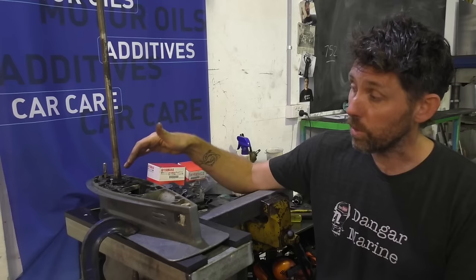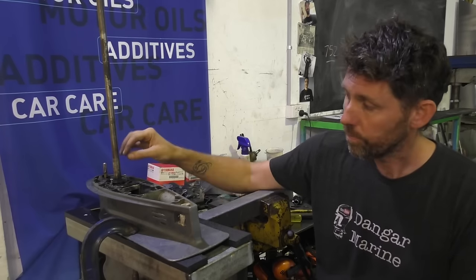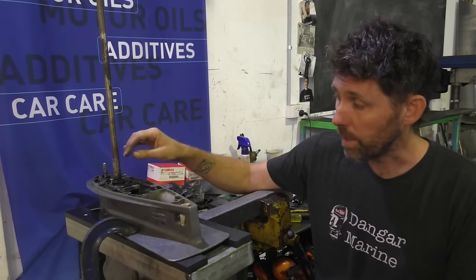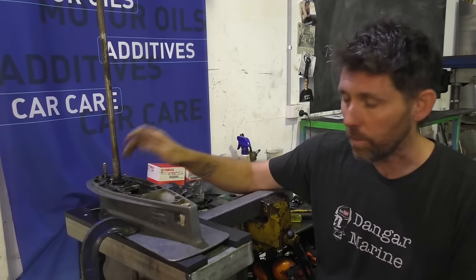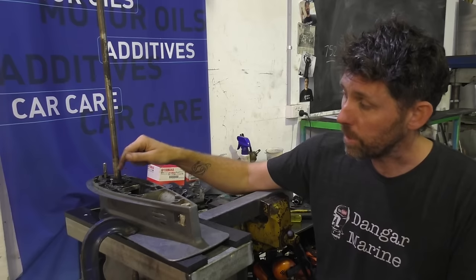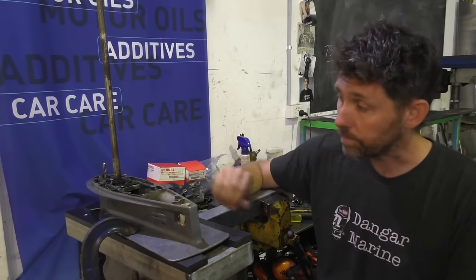Now it goes without saying this oil seal housing below that plate is heat affected, not really usable. I don't really have any immediate plans to repair this gearbox, so I'm not really worried about it. Otherwise maybe I would have found another way to get that corroded woodruff key out. But what I've done here is I've put a couple of screws into this housing, and I'm going to use the slide hammer just to pull it out.